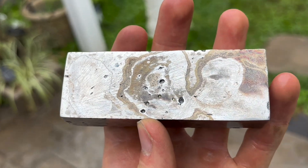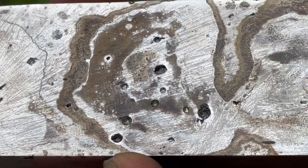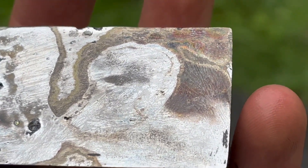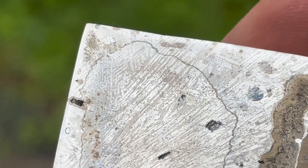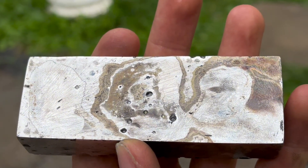Let's imagine that we used a hydrofluoric/nitric acid-based etchant on this material. First, the hydrofluoric acid is going to strip that oxide, and then the nitric acid is going to be able to attack the material. The alpha aluminum is much more reactive to the nitric acid than the theta aluminum, so it's going to be preferentially attacked. A significant amount of that alpha aluminum is going to dissolve, resulting in trenches where it exists, and thus high points where the theta aluminum exists. My thinking is that these high points and low points within the eutectic result in it scattering light, which makes it appear whiter, and thus the contrast between the eutectic region and the intermetallic rods is reduced. As for why all the other etchants didn't work, that just comes down to the chemical reactivity of the material. Hydrofluoric acid is strictly necessary to strip the oxide layer off the surface of the alpha aluminum — without it, the alpha aluminum is never attacked. The theta aluminum is also rather chemically inert and resists attack from most of these acids, with the caveat being any galvanic corrosion that occurs.